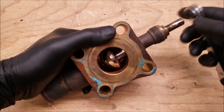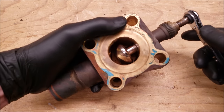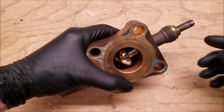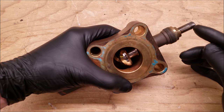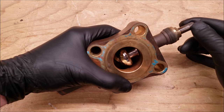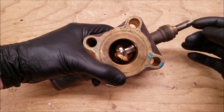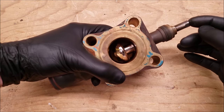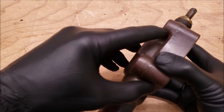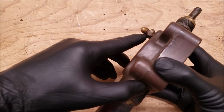The next position is the mid-seat position for checking the refrigerant charge and adding small amounts of refrigerant. It is 180 degrees turned clockwise downward from the backseat position. All you're doing is moving it clockwise 180 degrees, and you're opening up a tiny opening in order for the refrigerant to come over to this port right here.